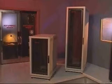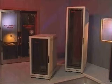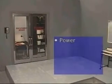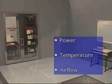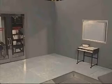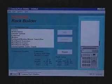The first section will introduce the Compaq Rack 4000 series and review the Compaq Rack 7000 series. Both series are designed to fit all 19-inch industry standard Compaq rack-mountable products. Environment and space requirements, including power, temperature, and airflow, will be covered to ensure optimum performance and minimum maintenance of your rack cabinet system. To help plan your rack configuration more efficiently, Compaq provides a software utility called Rack Builder, included with this manual. Refer to this software as an additional guide prior to component installation.